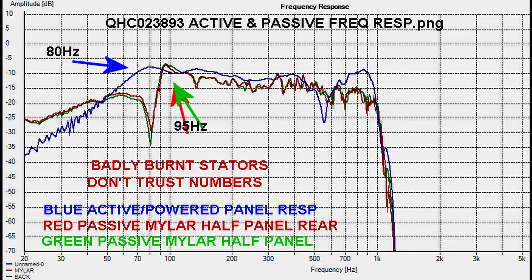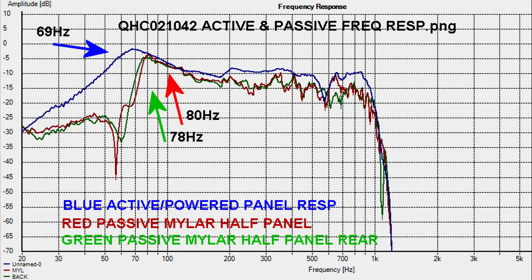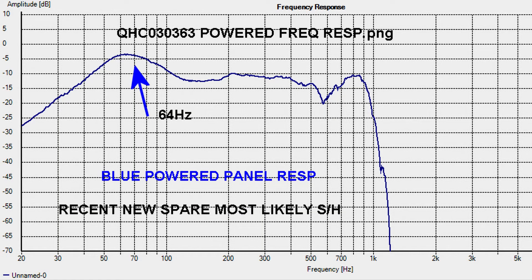This one is a late model panel from my 2912. I can't trust it because it seems to have very high resonances, and I suspect that's due to the fact that there's a big hole in the diaphragm as well as it being shrunk by the heat — it was quite a fire when it all happened. The following five graphs I sort of trust; they're mostly from new panels and the results seem quite believable.